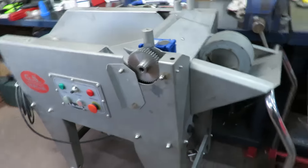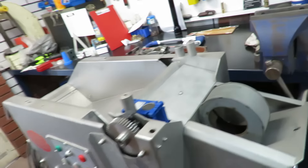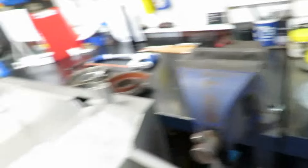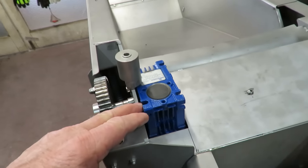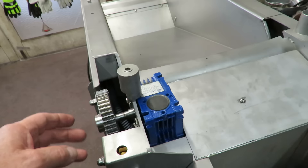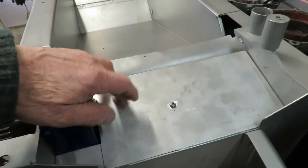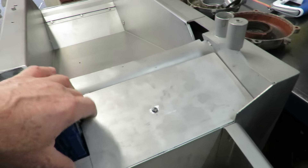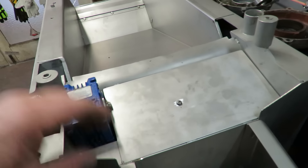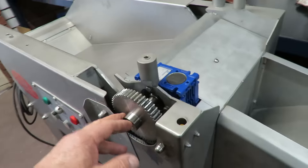So what we have here is a breadcrumbing machine, and I worked on that during the week and rebuilt it. I put a new fan down below. The gearbox couldn't be removed in its present state — you just couldn't get it out of there, the gearbox and the motor. So what I did is underneath this plate is a plate that's been welded in after they fitted the gearbox. I made a cover plate, notched out a window, and I could take that gearbox out, fitted a new one onto it, and cleaned everything up.